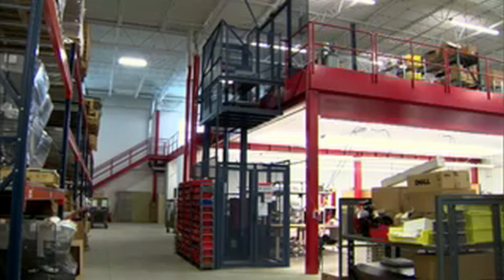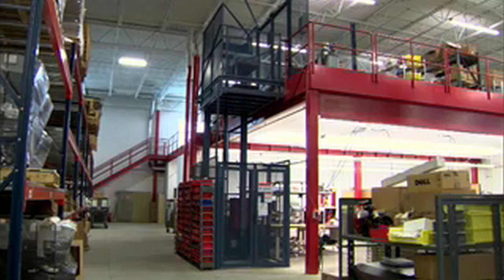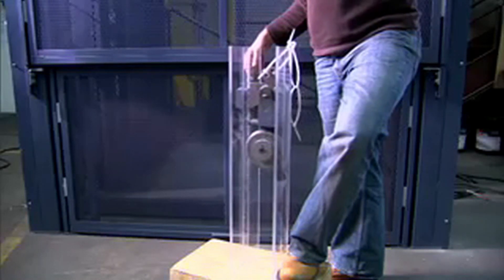The more common occurrence is brake slippage. Like any mechanical brake, the brake on a lift needs occasional adjustments, even a fail-safe brake. When a chain breaks, the safety cam engages. However, when the brake slips, the chain or cable keeps tension on the safety cam spring and does not engage.